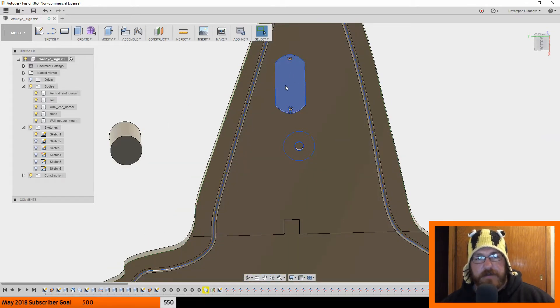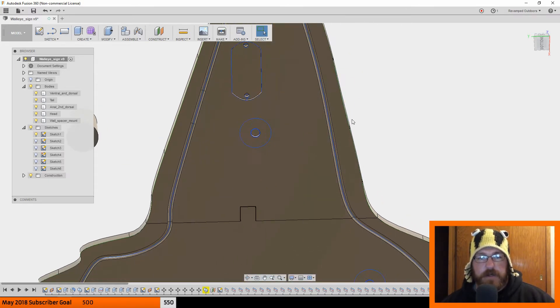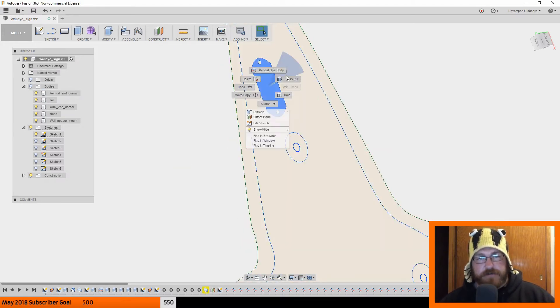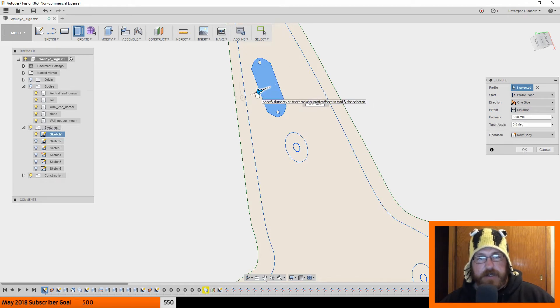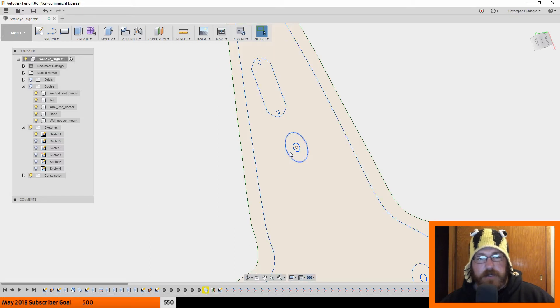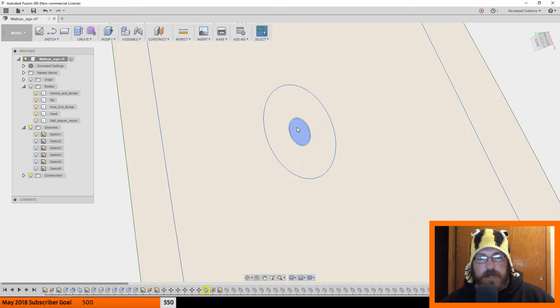For mounting the transformer for that little light — it has a little box with it — that goes right here. I just measured that and made a little cutout for it, similar with a press-pull function. Pull it up, it cuts it out after you have your original sketch. So the sketch is in there, you just press-pull that out or in and it cuts the body. I also created an offset circle of about 0.3 millimeters, and that allows it to fit in there no matter the discrepancy with the printer.